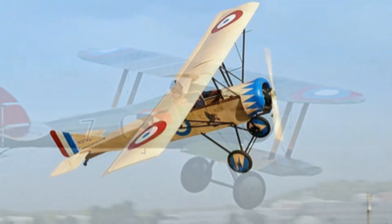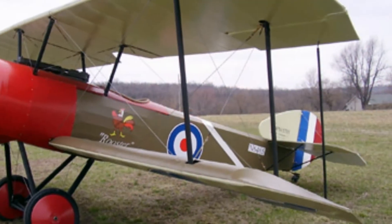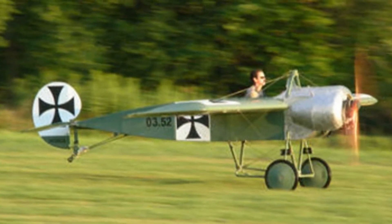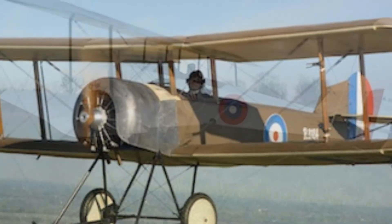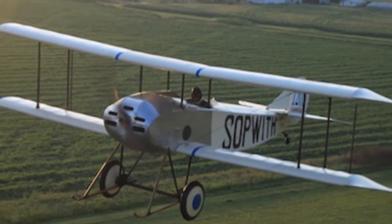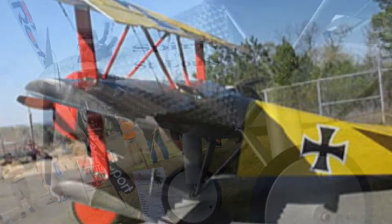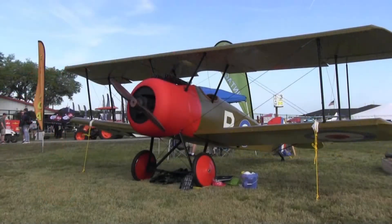Where do you come up with all this detail? Again, like we always do, we just contact institutions like the Smithsonian, which will often provide pictures or drawings. There's fortunately a lot of documentation on the Sopwith Camel — a lot of three-view drawings available for many years. We take those standard three-view drawings, determine the chord and span, plug in our airfoil, and that determines our spar location. The spar location then determines the truss location for the rest of the design — fuselage and cabane. We start with the overall size, determine the airfoil, and the airfoil drives the rest of the structure.